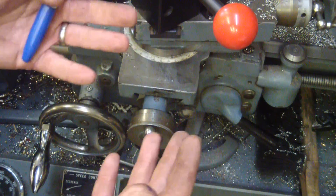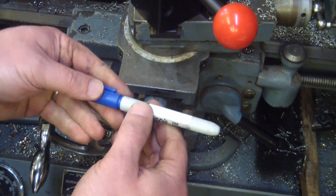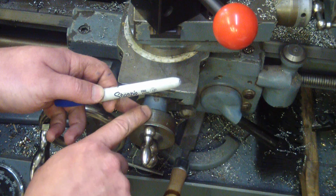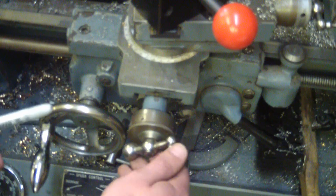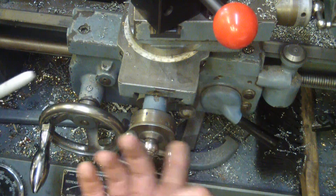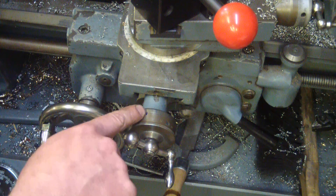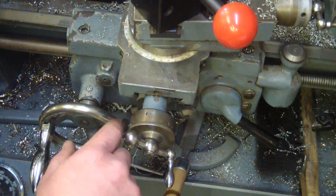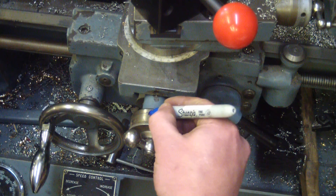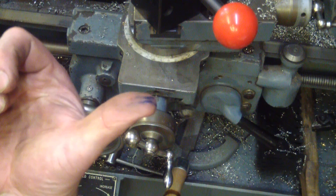I've been called a lot of dirty names, but I've never been mistaken for a machinist. But here's a little trick — it's the poor man's DRO. What I do is I touch off, and then I know I've got to go 30 thou. I'll just mark that with a Sharpie where I've got to finish up, so even if I lose my mind, I know that little mark is there and I'm aiming for that little mark. Then once I hit it, the good thing about the Sharpie is you can erase it with the solvent — you just go over it again and Bob's your uncle.